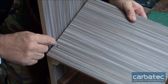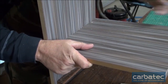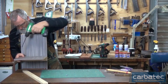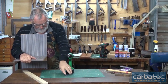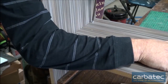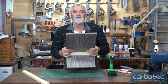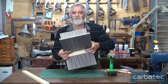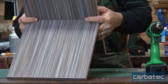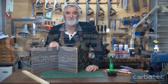I've got a couple of pre-drilled screw holes in the shelf — just line that up. And there's another way of securing bookshelves: a cleat on the bottom and then a couple of screws to hold it in place. Whichever way's easiest — it's only to hold books after all.